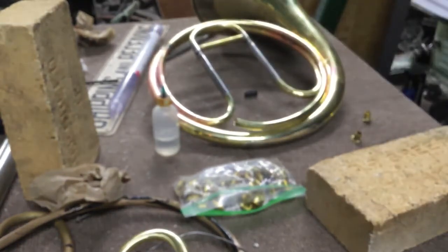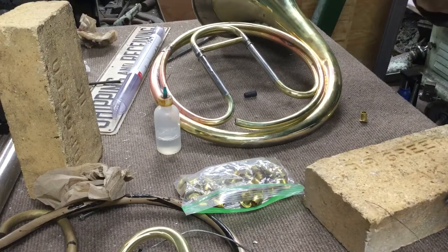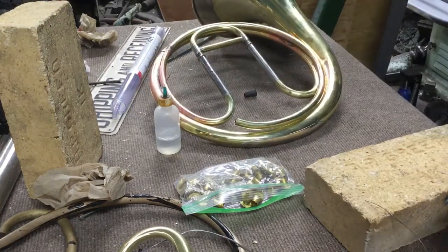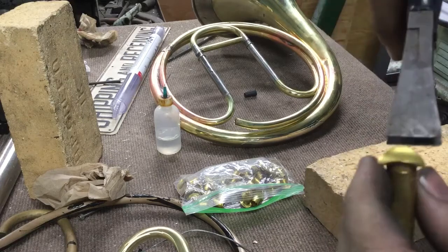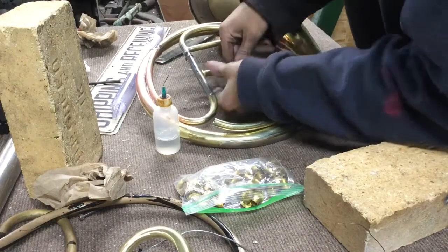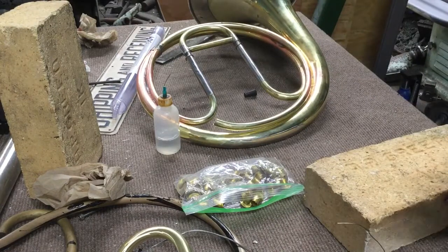Look at that — I have one already cut. It's like it was meant to be. The way this brace works — it's a tube brace. Brace goes into tube. You don't need to put wicking in there to stop rattling because if you solder your thing right, you don't get rattling. So whoever told you that was crazy. These are for much larger tubes, so you take duck-bill pliers, grab onto that, curl it in there — nothing crazy. Press it on the tube. Once we get wire on there we'll take a burnisher and burnish it out. You could do this without wire, but I don't like that. What you do is take a pair of pliers and oval your socket so it's snug inside the tube. I don't like doing that.